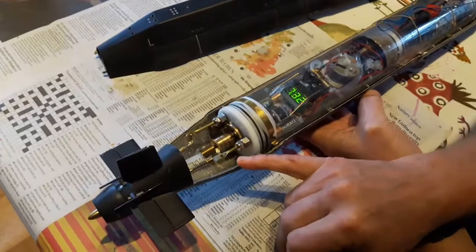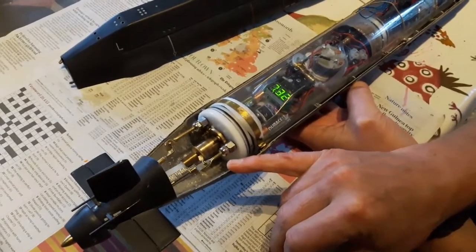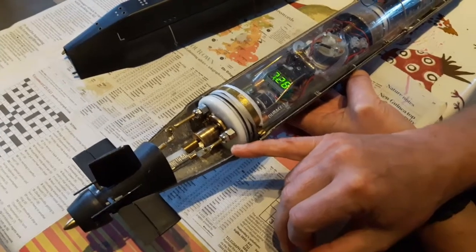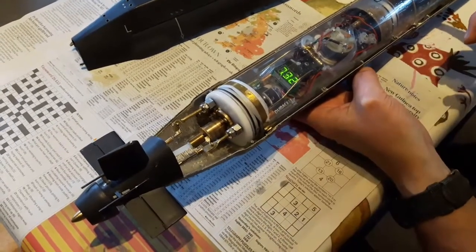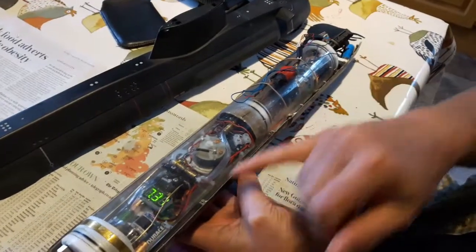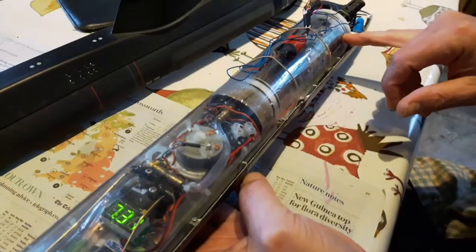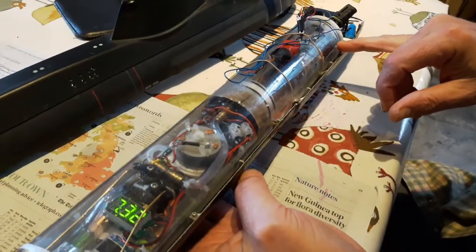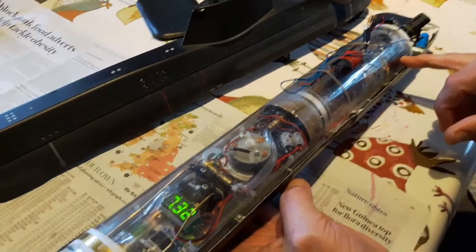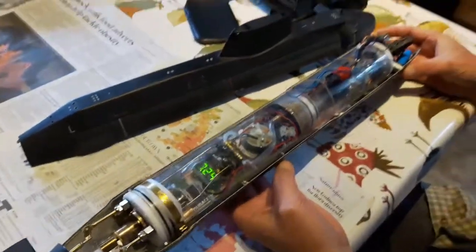I did used to have the batteries in the back, but it's very hard to waterproof those, and if they leak current then the antenna stops working. So I brought all the batteries back inside — you can see them, little Duracell rechargeables. Those are all now safe inside the dive module thing, so they are not leaking electricity, and it works very well.